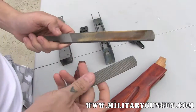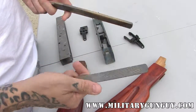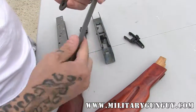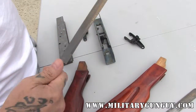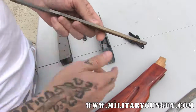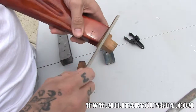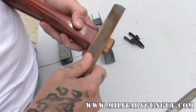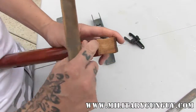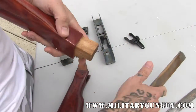The tools that I like to use are files. I love files because they cut quickly and they give you a little bit more control than a Dremel or a belt sander. This is a rasp — it's dual edge, so it's got a concave rasp and then a flat rasp. Then this is a bastard style file — you can tell I've used a lot of it. I like this edge because if you're looking for a nice clean edge, you can use this file just like that. You can see maybe this gap that I'm going to try to clean up — it's not quite even, and it's a little bit concave, and that's usually from the rasp.